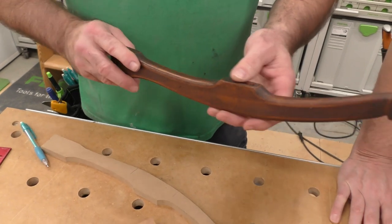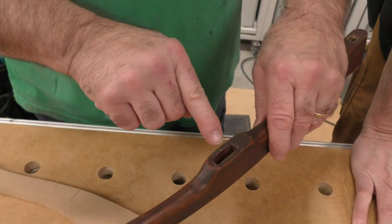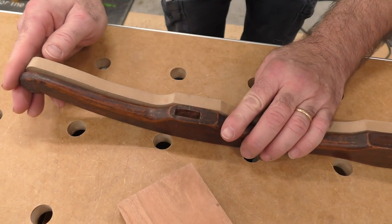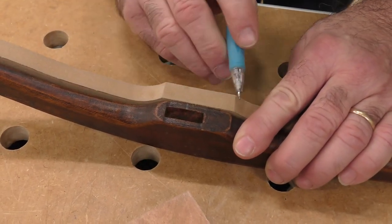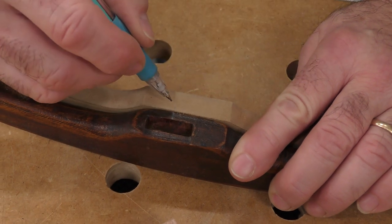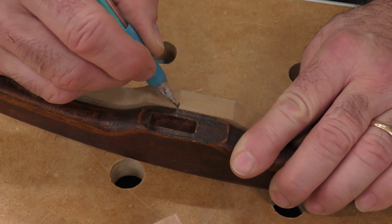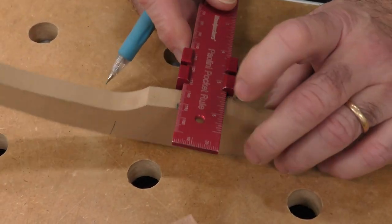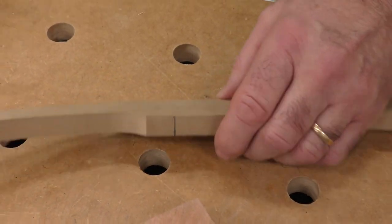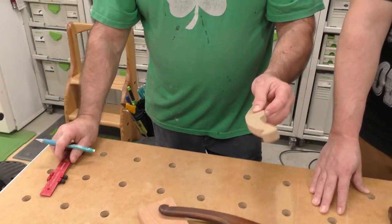As I took the original piece — this is 25 millimeters long — I divide it in half. See the little tick mark I put there? I'm going to take this piece and match it up just like this, making sure that the top of the horns are even. The reason I'm doing this is I could put it exactly in the center, but the tension won't be where I need it. This is why I love using an old piece or an old saw like this — it takes all the guesswork out. I'm just going to scribe this line, and you'll see what that's for in a little while. That'll help me when we reference this board on the right face to get it exactly in the center for a stretcher with the eight millimeter domino.